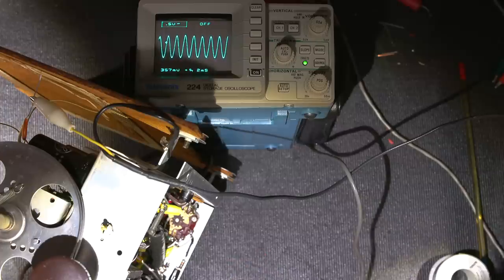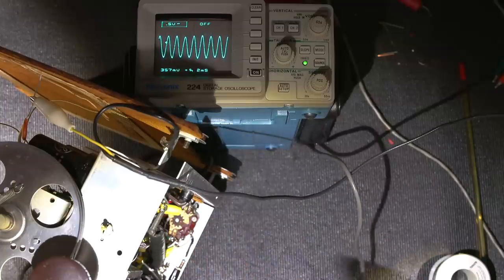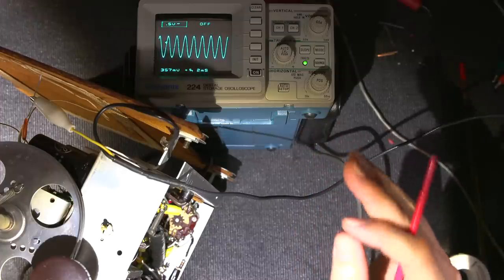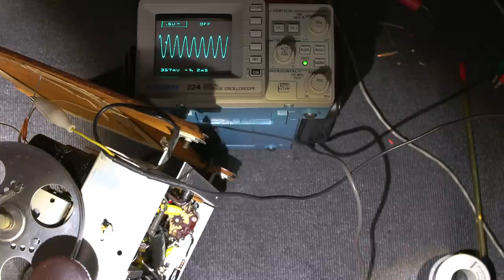And then what I'll go do now is I'll go back to the top, readjust the top, bottom, and then move over to the second one and go top and bottom just to squeak the last little bit of absolute gain out of this. Again, just looking for maximum amplitude on this. And then the IF section in this is tuned correctly for 455 kilohertz. That's it. Now, what we'll do after this is move on to the oscillator and antenna alignment.